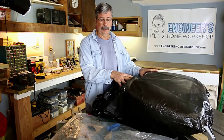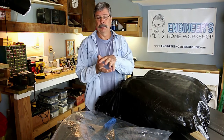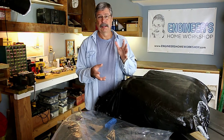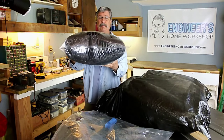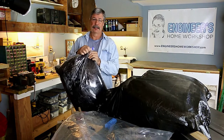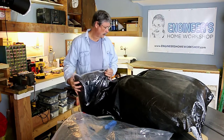I'll draw a vacuum on the garbage bag, fit the foam in, and it will re-expand to the size of the bag. It won't be flat like a pancake as a vacuum bag might produce — it will expand to the radius that the bag can supply, giving you a somewhat rounder tube shape. The bag is holding the compressed foam, not maintaining a vacuum seal, and it expands to the restriction that the outer bag produces.